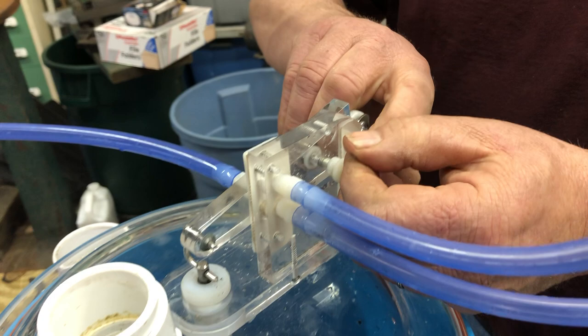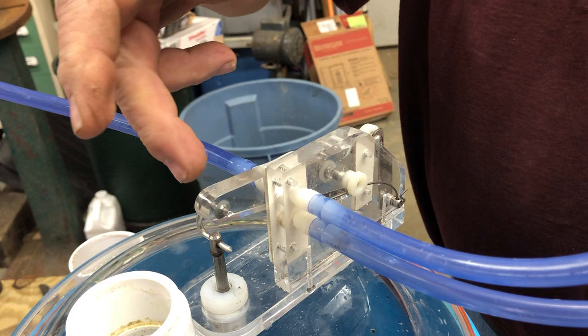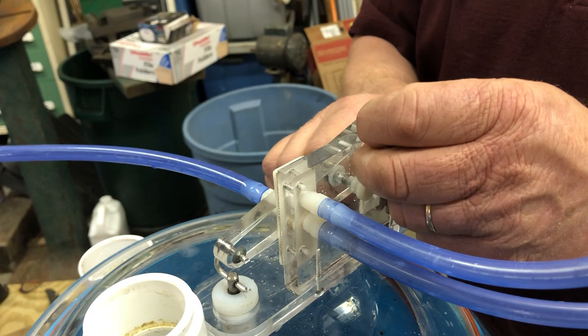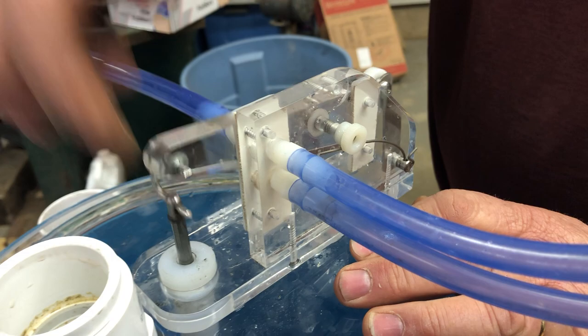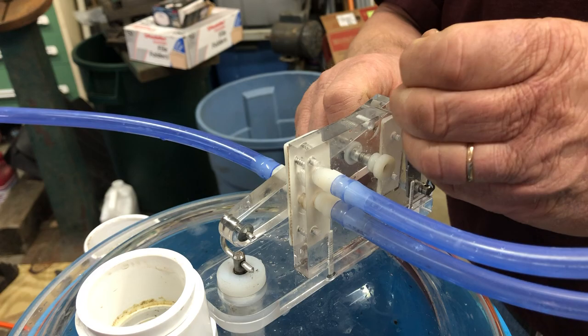I usually go by how much sap comes out of the machine. That's too much pressure — see how it's hung. So you have to adjust somewhere between those two points. You take this and bend it back towards you to get your adjustment point where you want it, so that it goes up and then drops but hangs a short amount of time. That seemed too quick for me.